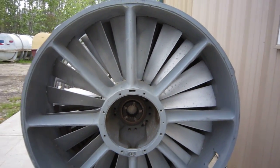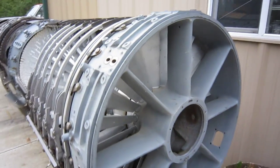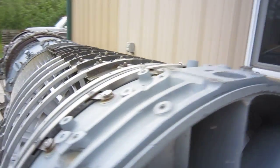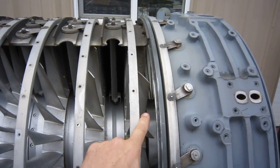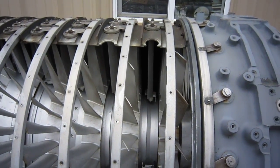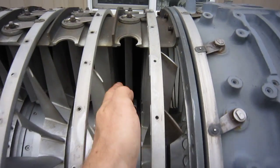It's missing the nose bullet fairing, which we've recently been looking at. This is the front frame and the IGVs — the VIGVs — they're variable in angle. Looking at the cutaway here, these are the actuating rings for the VIGVs, and there's the first stage of the compressor. Look at that — it all moves.